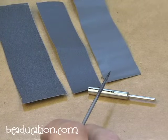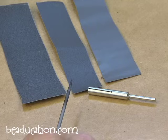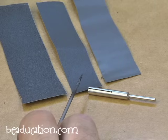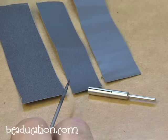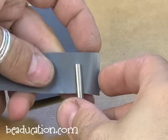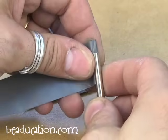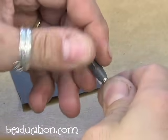One of the least expensive bits you can use for polishing is a split mandrel — a simple steel cylinder with a slot so you can thread sandpapers to use them as rotary tools. These are normal hardware store sandpapers. Look for 180 grit, 320 grit, and 600 grit. As those grit numbers get higher, the sandpaper gets finer and so does the finish. To use it, thread the sandpaper into the slot — the right-hand side of the paper is short, and you curl that around and wrap it around the mandrel to get it started.